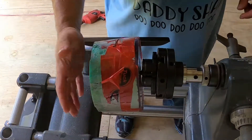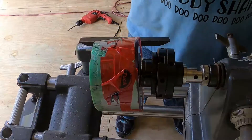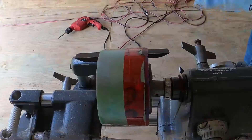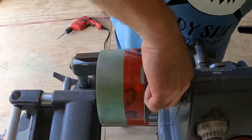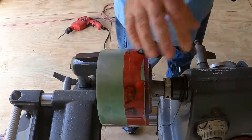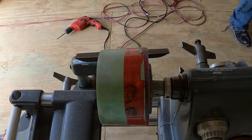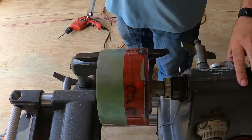So much for plan A — the worm screw's not holding, so we'll screw it to a face plate. Plan B: we have it mounted to a screw-down face plate and then mounted to our headstock, so that should stabilize it a lot better. Let's get this trued up and see what happens.